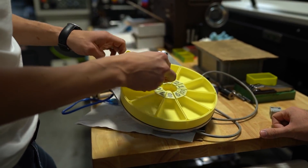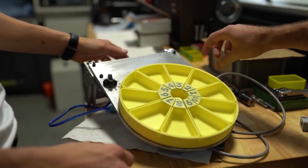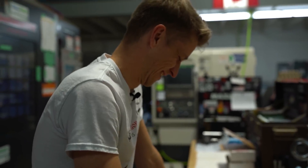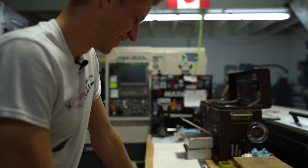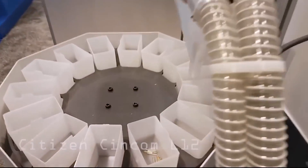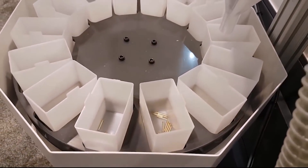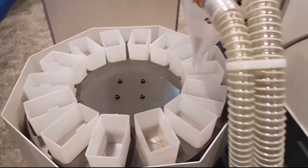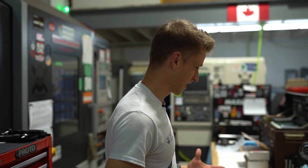It's very smooth. Everything's clocked in place. I did think about doing some sort of belt drive with the motor offset, but it was just sort of unnecessary — so direct drive right underneath. This is so cool. When I was at IMTS 2016, I saw a Citizen lathe that had something like this — it would air-suction the part out of the machine and dump it into one of these. And I was like, that's the coolest thing ever. I've been crunching that idea now for almost three years and I'm super excited.